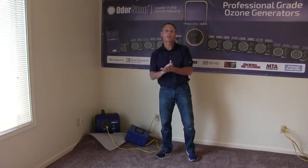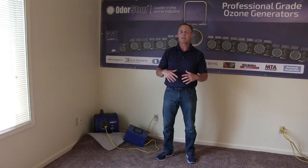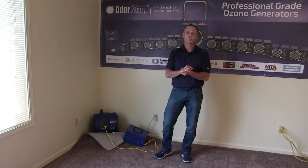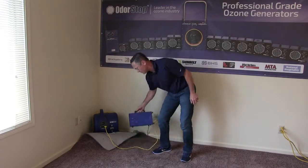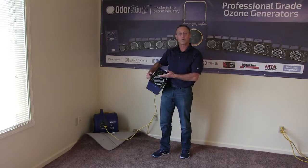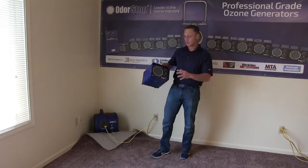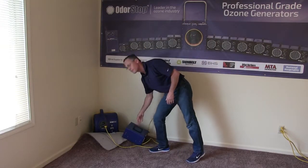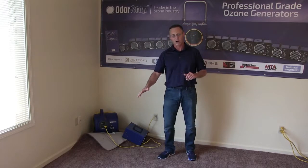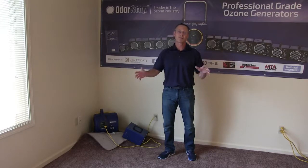A couple things to consider. First, you can expect there's going to be a really bad smell. If it's been a few days since the flood and it's hot out, it's going to be really bad and could be bad for a while. For dry time, try 12 hours at a time. The beautiful thing about our ozone generators is they have a timer — up to a 12-hour timer with a hold function. You can set it for 12 hours, it'll count down and shut off. So if you want to leave for the day, you'll come back tomorrow and the ozone will have shut off but the blower will continue to run. Also, the carpet will dry much sooner than the padding underneath — the carpet might be dry in four, five, or six hours, but the padding could take days to dry, so you'll need to check that.